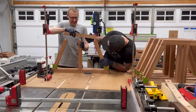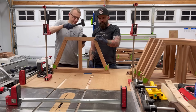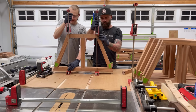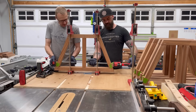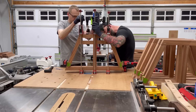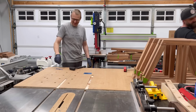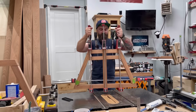So again, working together as the dream team that we had become, we started hooking all of our frame pieces together. We would fill each hole with epoxy, get them roughly in place, put some clamps on the top, some clamps on the bottom to push in our side pieces, and some clamps with these interior clamping cauls to bring those side pieces out flush with our top and bottom brace pieces. If you're confused, I mean, join the club. So am I. With glue ups like this, you just try and get enough clamps on there to make sure everything's got adequate pressure and do what works.